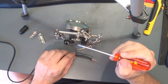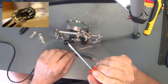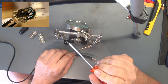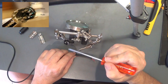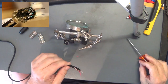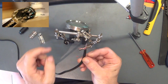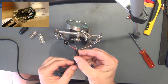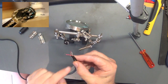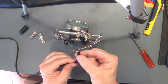If you have a look at the schematics you can find on the net — this is the audio pin, so I'm going to connect audio here, video to that pin over there, and ground to that pin over there. Those are the three pins you're going to be using. That's going to be my ground, which I'm going to solder to that pin over there, and then I'm going to use one of these for the audio and one for the video.